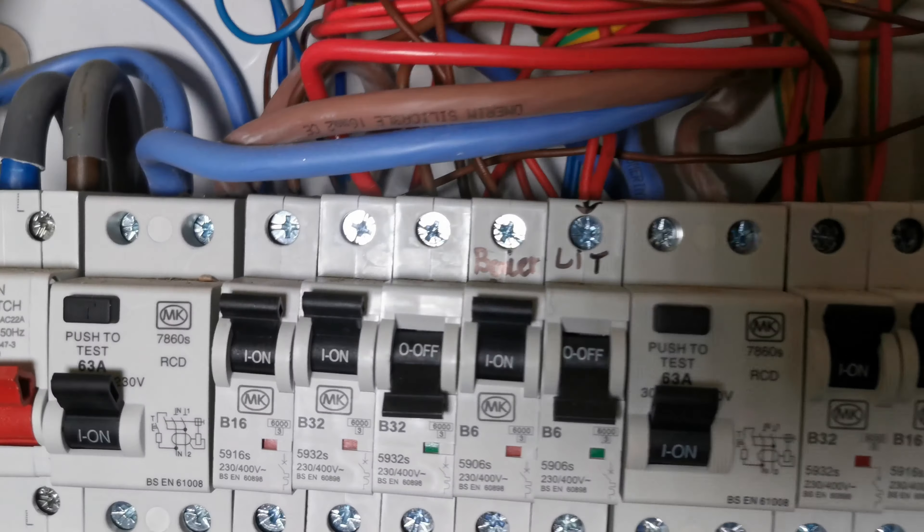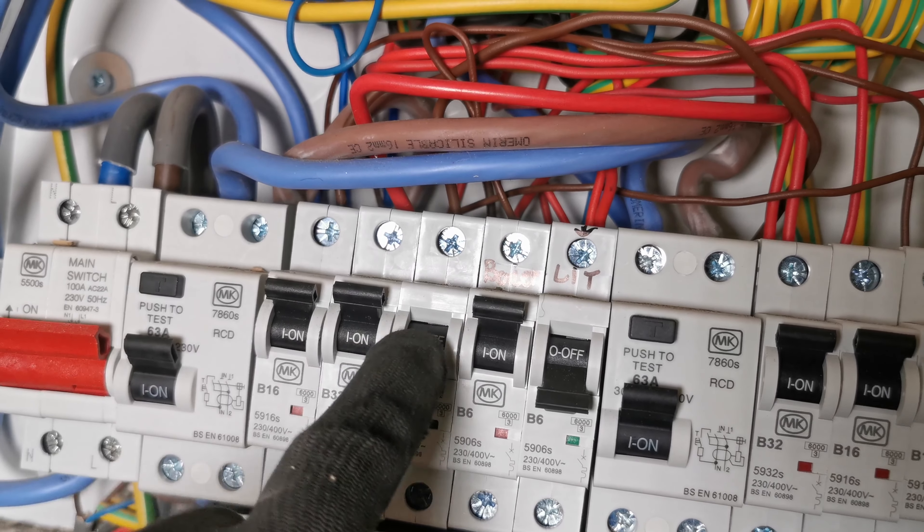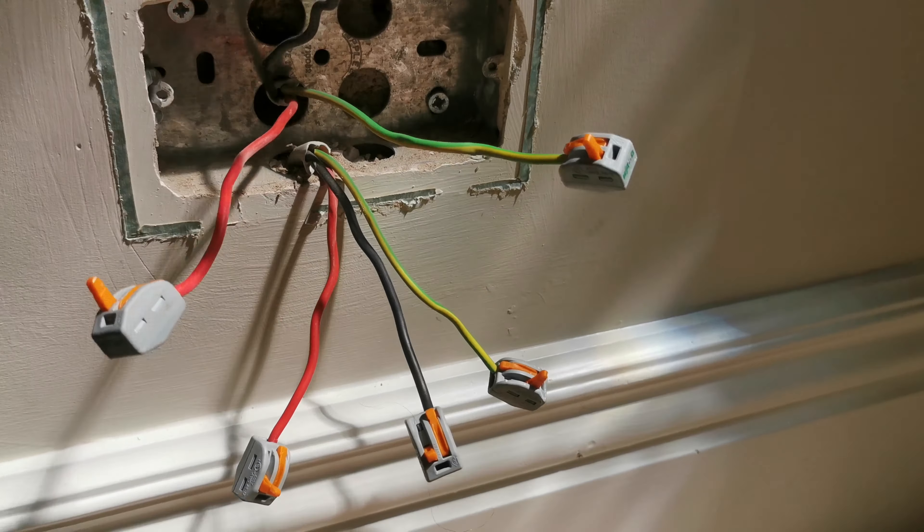The way we fixed that — a socket circuit is wired as a ring. So you've got your fuse board, it comes out with 2.5 cable and goes from socket to socket all the way around and back. What we did was take the ring — you've got three cores each — and put them on separate breakers. I put one into one MCB and one into the other, then went into the circuit roughly in the middle, disconnected it, split it there, and put some lever connectors on. Lever connectors are dead easy — you pull a lever up, push your copper in, and snap it back down. Really quick for fault finding.